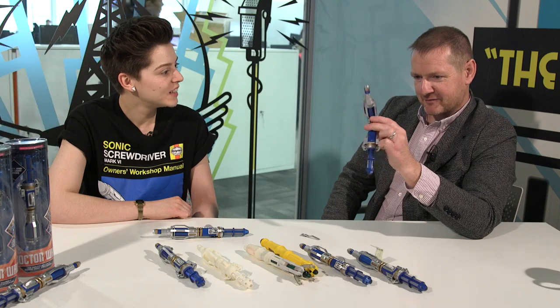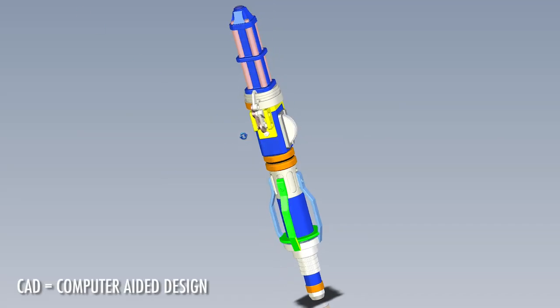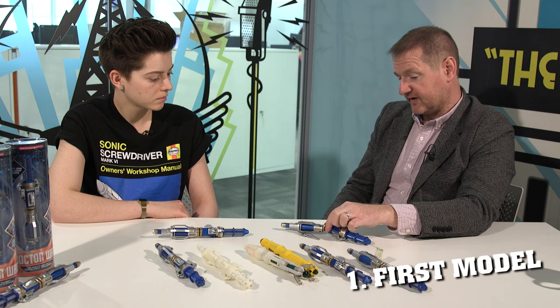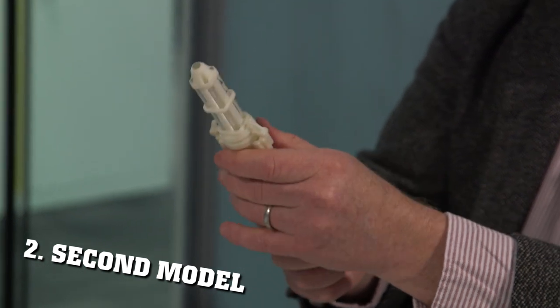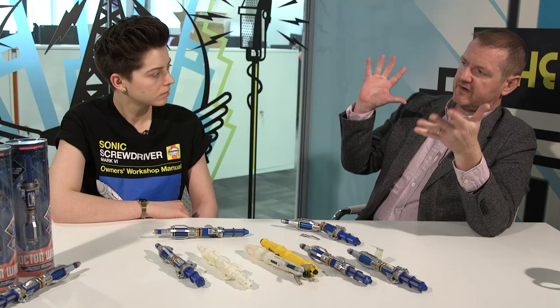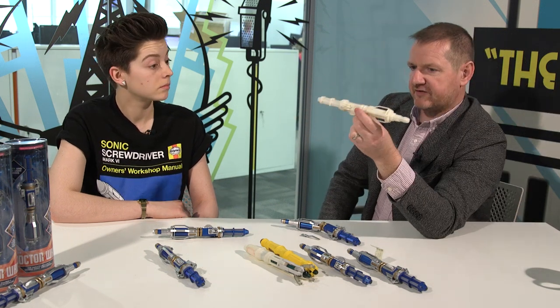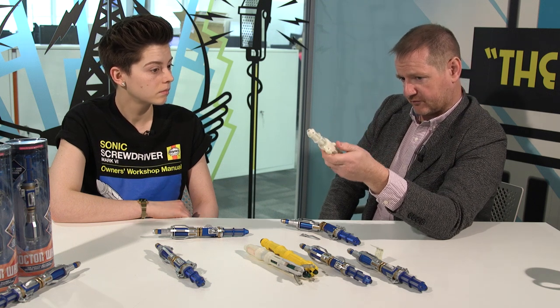Is this a test version? Is that why it's broken? This was a model, and it's now looking very unhealthy. We create the model in CAD, and those are output as basically a model to get painted, and that's exactly what this started off as. They make a second model that they don't paint, and they use that to cut the steel to make the great big steel moulds in polycarbonate and ABS and various other things. The first time you run plastic through it, you get this, which is basically a non-working version.